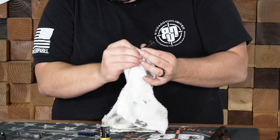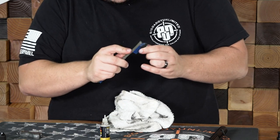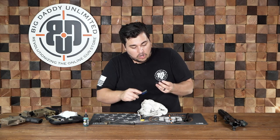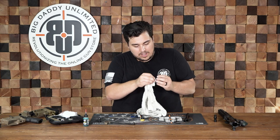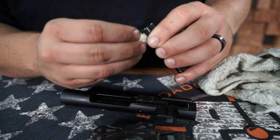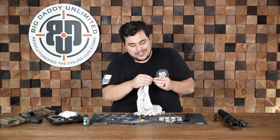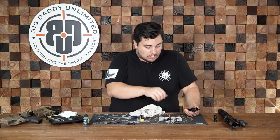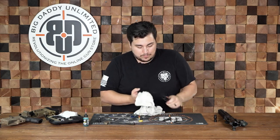With the bolt, you're just looking at all the cracks and crevices, any little tiny crease where carbon may build up. You'll get your brush and get into all those hard-to-reach places. Don't forget as you're going along, look for things that just don't look right. Even if you don't know exactly what you're looking at, it can be fairly apparent — if something doesn't look like what it's supposed to, take it into your gun shop and have them take a look at it. On the bolt you also want to get in between each of these fins on the end, make sure you're cleaning out in between them, and confirm all of these are uniform with nothing broken and no unnatural wear on one piece. Once each of those smaller pieces are cleaned, you'll go ahead to your actual carrier group, get a rag, get some cleaner on it, pick a spot and just start scrubbing away.